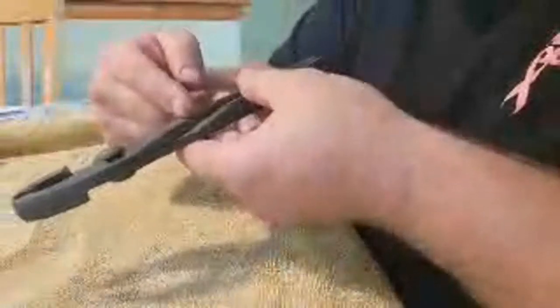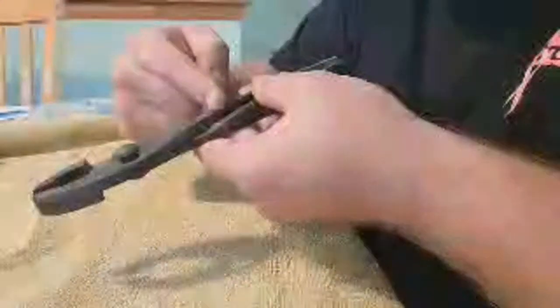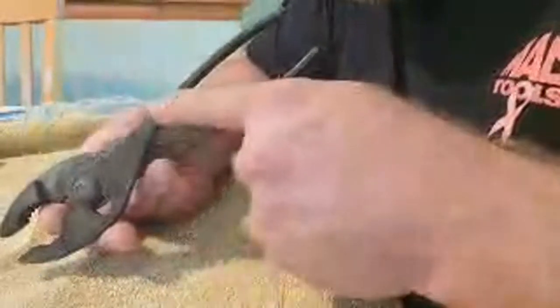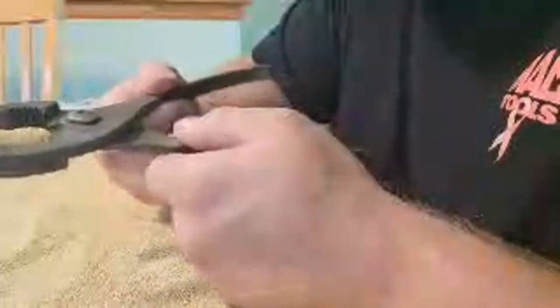And then this morning when I woke up, I dropped it down in a baggie of CLR, and you can see from this point here, there's a line right here. That line is where that baggie had the CLR up to, and I wanted to show you guys the difference. See how it's more dark right here, and then down here it's lighter. This is that second coating of CLR from here down. And it took most of the residual rust and stuff off of it in general. I've seen people say use vinegar and let it sit 24 hours and what have you, but the CLR is here, so why not use it, right? So that's what I did.